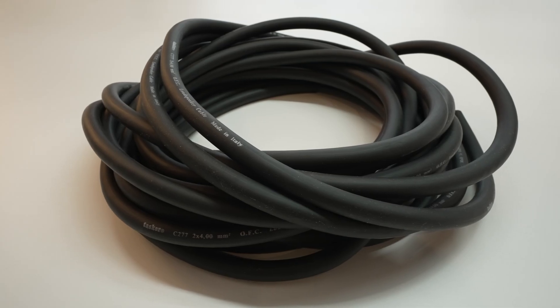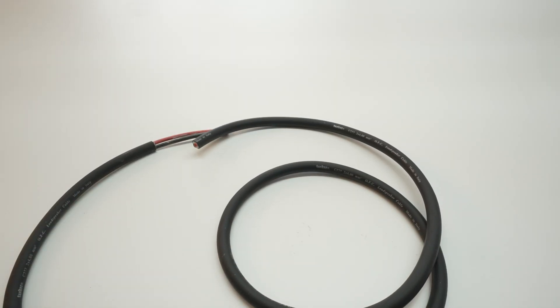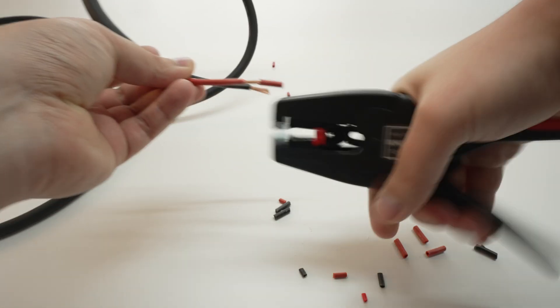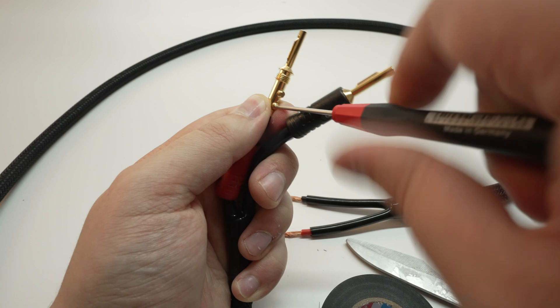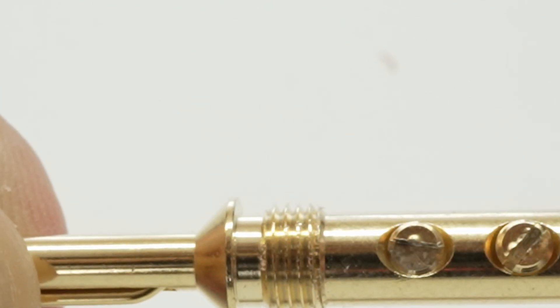Finally, we are going with the overkill cable — 4mm wire and the QED banana plugs. Same procedure: remove 75mm of extra insulation, use the 9.5mm sleeve. However, this time expose 15mm of conductor and we will not apply any ferrule — the size is too large to fit with a ferrule. Instead, we're going to rely on the tight fit and thick insulation of the wire to act like a plug and not allow air to reach the conductor. Install the 14mm cable pants and attach the banana plugs. Unfortunately, the screws are made of some sort of soft material and break when you torque them too much — probably too much copper content in the alloy. It happened twice, so I'm guessing it's a regular occurrence. You have two options: be careful how hard you tighten them, or just go full blast and if you break them, make peace with the fact that you will not be able to remove the plugs.